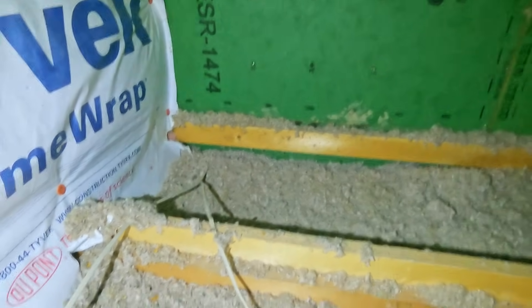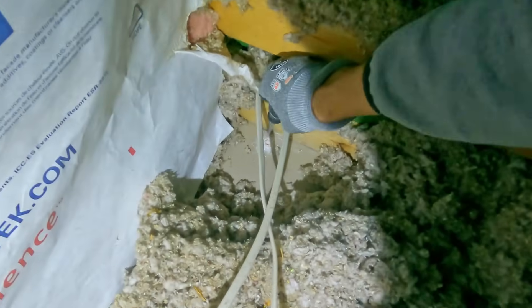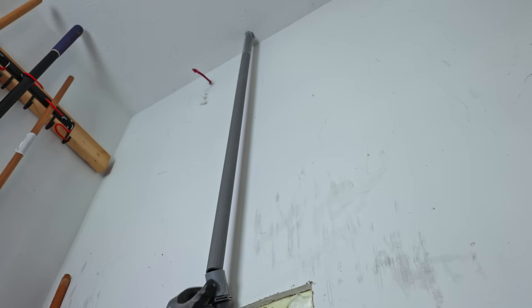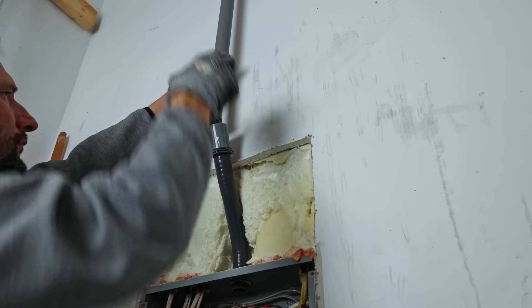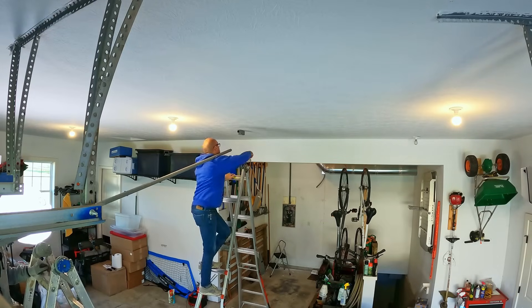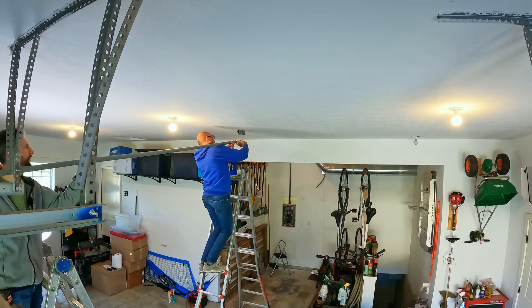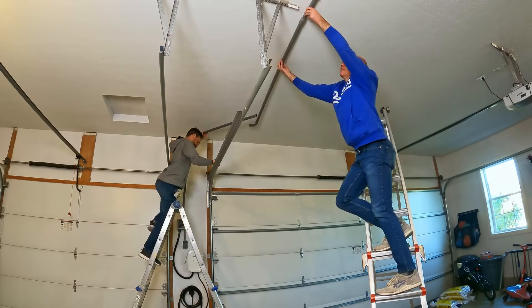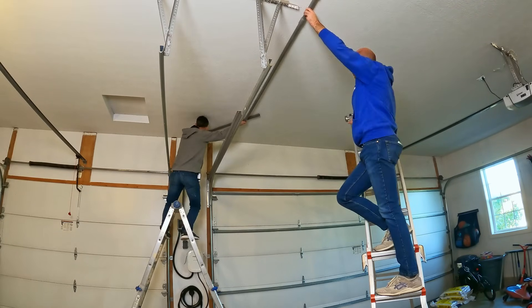To come up into the attic, I'm starting from the attic so I make sure I miss all the exterior sheathing. I'll dig a hole down into the insulation and poke through right above the power panel. Since the sub panel is inset in the drywall, a section of one-inch flex works perfectly for popping out of the drywall and makes routing up out of the box easy. You could also bend some conduit if you prefer. Popping up into the attic is a convenient and clean way to route the conduit, but because there's a living space above the garage we couldn't do it the whole way. So I used a 90-degree elbow up into the attic, a 90-degree elbow to drop back out, then a 90-degree access body to transition to the ceiling of the garage and aid in pulling the conductors. Now I have one-inch conduit routed from the sub panel at one end of the garage to the junction box all the way at the other side.